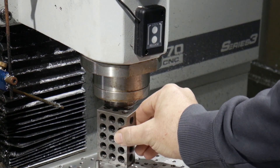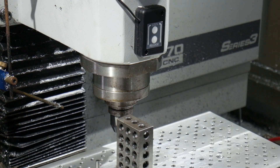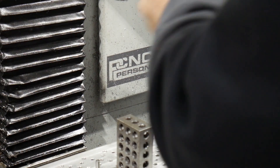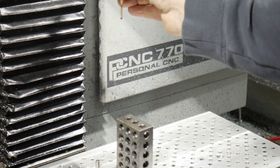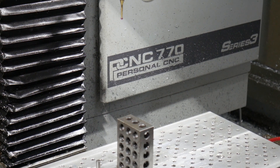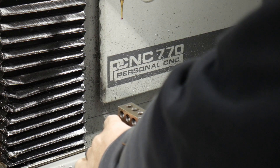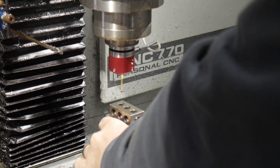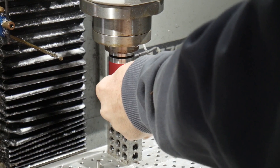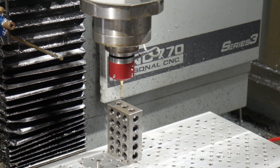All right, there's our reference height off of this right here. Hit the set reference height button with it on tool zero, then install our probe. We'll get that close, enter 99 in the tool DRO. We're going to check settings and make sure we have the probe set correctly.